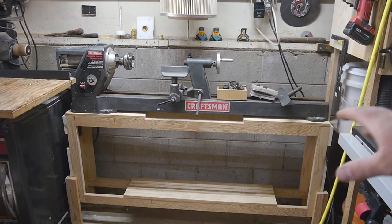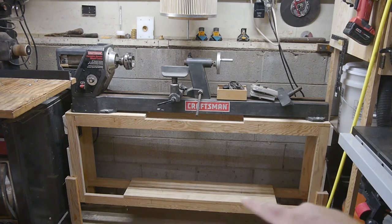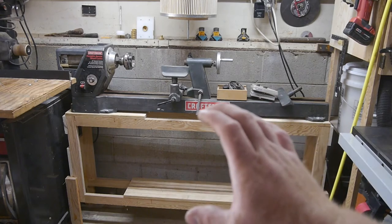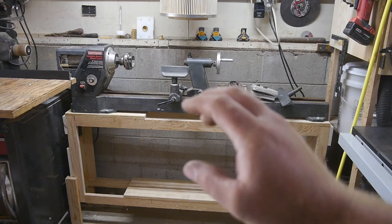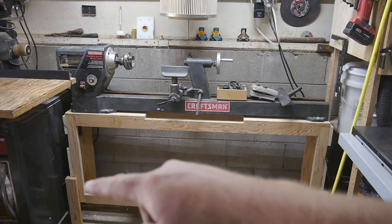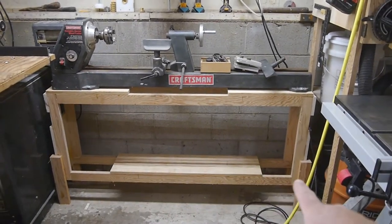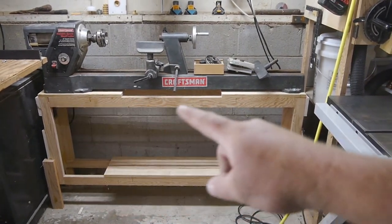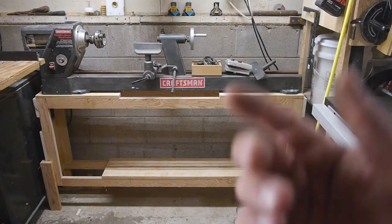What are we looking at here? We are looking at something I threw together ad hoc. This frame was actually made for something completely different — it was my first stab at a wood holder for scrap pieces of plywood and whatnot, but I scrapped the idea. I built this about two years ago when we first moved in. You can look at these legs — they're just glued and nailed in on the sides, kind of after the fact. These are half-lap joints going across here in these corners, and then just plywood connecting the two.